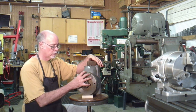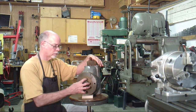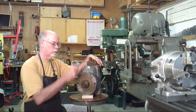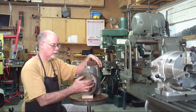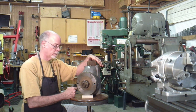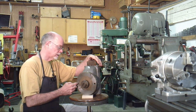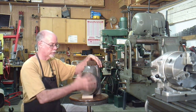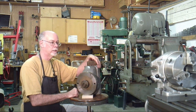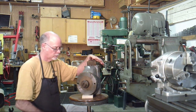So the idea is we're basically going to build a cylinder, and it's going to have some holes inside of it to have clearance for the rotating parts here and the rotating parts on the mill. And we'll be able to bolt it directly to the column of the mill, and then we will have T-nuts in slots so that we can bolt this in, and this will pivot. And then I'll have to make a driver. So basically, I'll either make or adapt an existing Cat 50 taper.